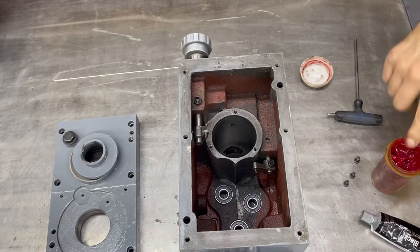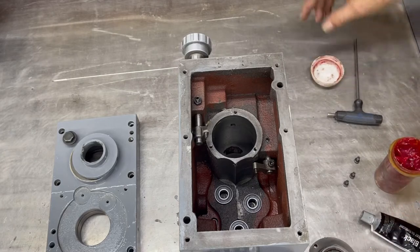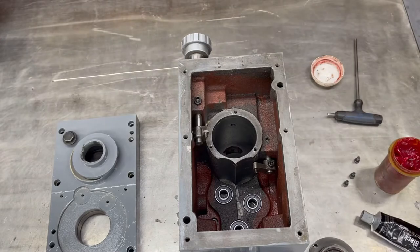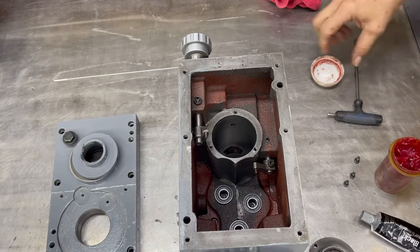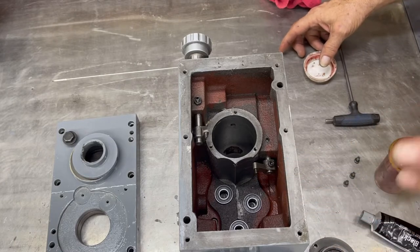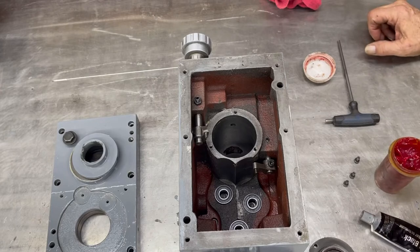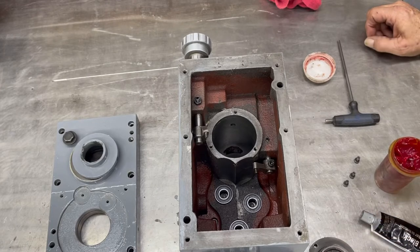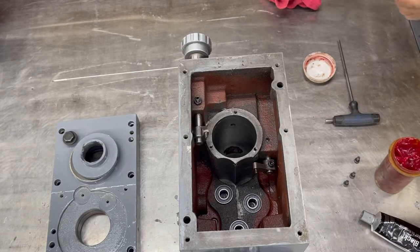is that oftentimes when you put new seals in, either they do not get lubricated by whatever they're holding in, sometimes there's nothing, they're just keeping dirt out, so to speak, or even if they are lubricated by the oil in there, when you first start it up and start spinning, there may be a few seconds, even more, that there is no lubrication, and it can burn a seal in a second. If a tight seal on a dry shaft spins for a second or two, it can actually burn the seal right off of there, burn the tip.